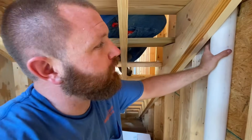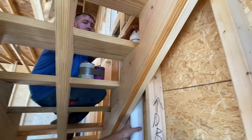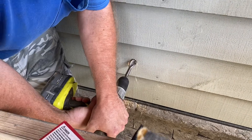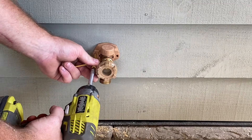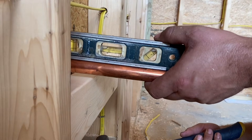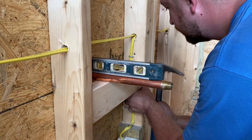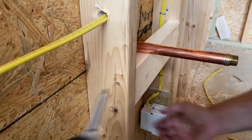How long do we wait? This is why you need two-by-six walls. It's two-by-four — look, it fits perfect though. Yes, it's a perfect fit, but you can't drill. You've gotta go through the wall. I don't want to make it too easy for you guys. Here we're drilling to install an anti-siphon frost-proof hose bib out onto the patio. The anti-siphon part means there is a valve that prevents backflow of water from outside to inside your potable water system. The frost-free part — the knob on the outside of the house actually shuts the water on and off about eight inches inside the house. When it shuts off, the rest of the water will then drain out because this pipe is set out of level. If you leave a hose attached to your hose bib in freezing weather, that can prevent the water from draining and cause this thing to freeze anyway.